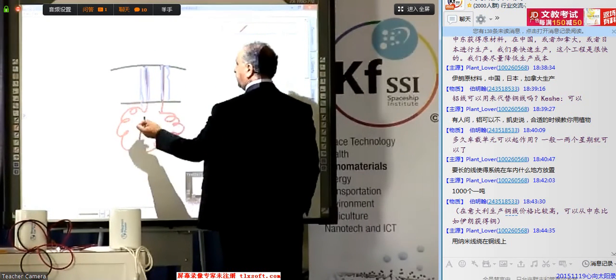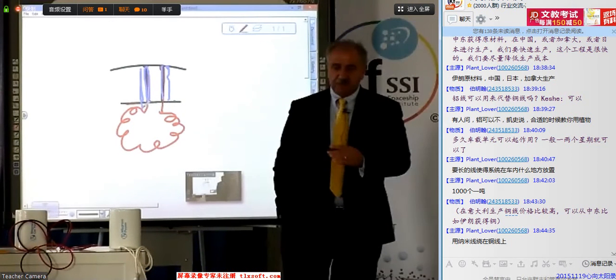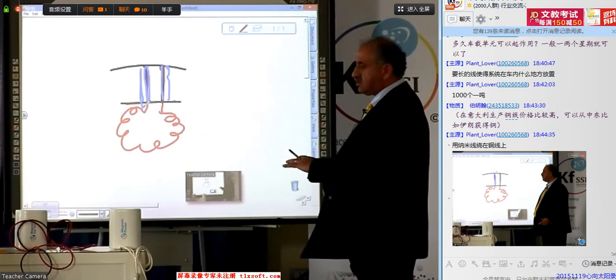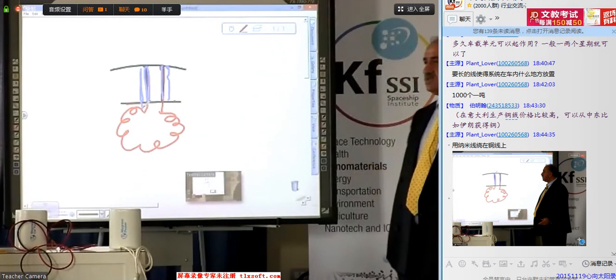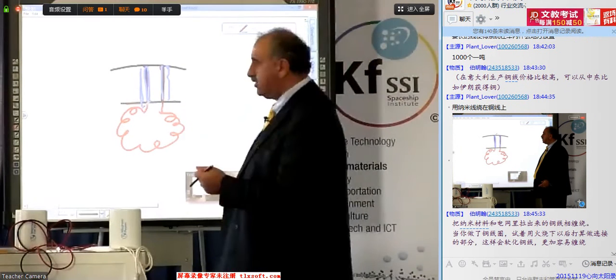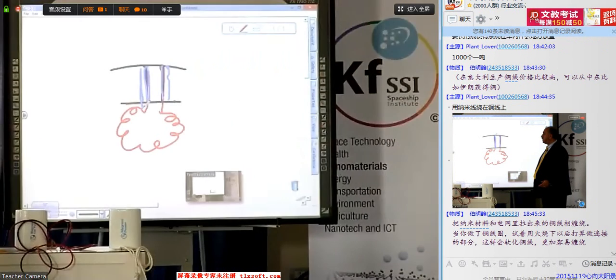Rigid copper wire is very hard to twist; you find problems. It's just the process we are doing now in the factory: the ends cross very high temperature, they become softened, they call it annealing, and then the connection becomes very easy in manufacturing. Even at home, if you find the twisting of the wire hard, soften it. I've shown you the difference. Marco, we've shown this before, if we can show it.